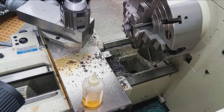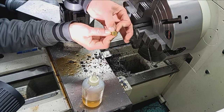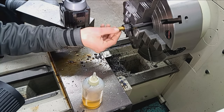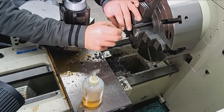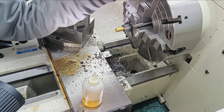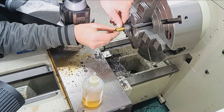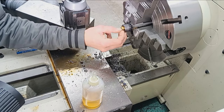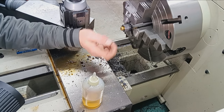And then another check. So any chamber, you always want everything encapsulated in steel, except your extraction rim here. So we're just going to verify visually that yes, the main body, everything ahead of this web, as they call it, the web of the case, so it's thicker in here as it, you know, kind of firing your primer sits in there, and then the case kind of is webbed real thick down here, and then it gets thinner a little bit past here. So you just want to ensure, especially on a cone breech, that that is actually sitting where it was. You don't want it like out here somewhere and blow a case out. Obviously that wouldn't even close on a bolt, but still.